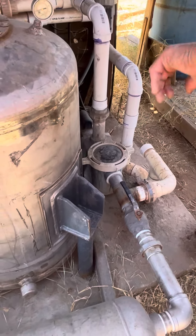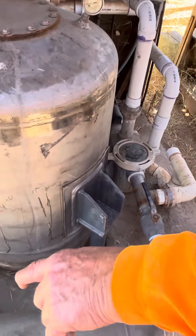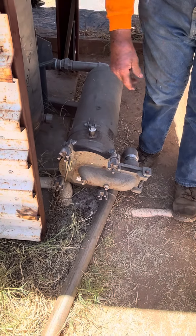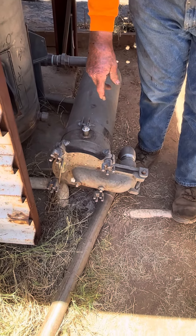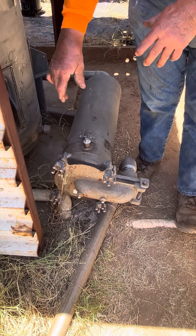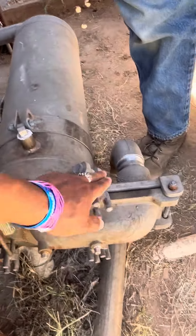You can put just a little skim of grease on it and put it back together — it's got an O-ring in it. And this here has an O-ring too. Clean it because sometimes sand will come out there, and you don't want sand on your O-ring. You clean it and put another film of grease on it, then tighten these all four up evenly and they shouldn't leak. One, two, three, four.